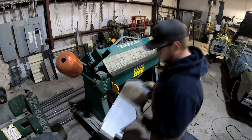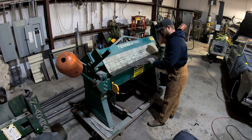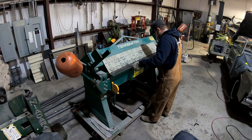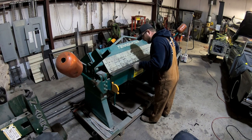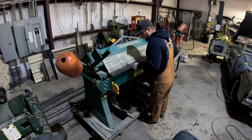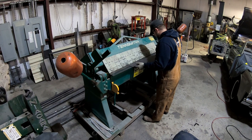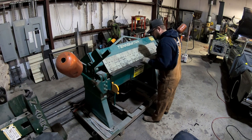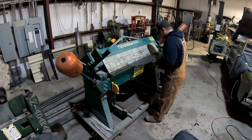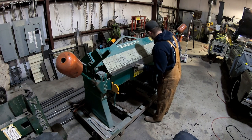This will be where it starts getting exciting. All I'm going to do — I have this already set up — take the brake, open it up, slide our piece in to where we have our scribe line. Line it up fairly closely with the scribe line but leave a little bit of room for it to roll. As I measured to the center, it's about an eighth inch — half of the circumference roll. Just going to eyeball it. Come out a bit, a little more room to breathe.